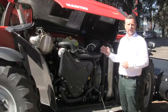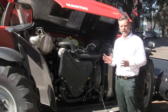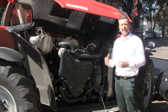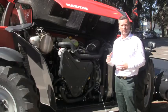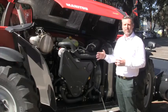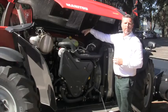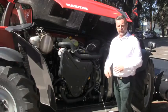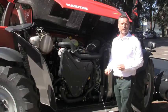In terms of the hydraulic pump — a very crucial component on a telescopic handler — on the Manitou MLT 840 with its 137 horsepower machine, we've got 180 litres a minute in terms of hydraulic pump capacity. The reason we're able to fit such a big pump is because of the side-mounted engine and the way the engine is mounted east-west, which allows us to fit the pump under the boom with a substantial amount of room. That gives us those quick hydraulic movements, quicker cycle times, and much better productivity.